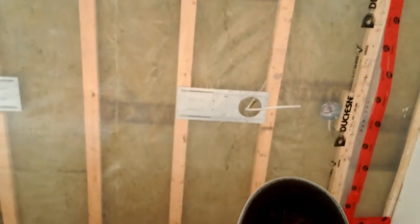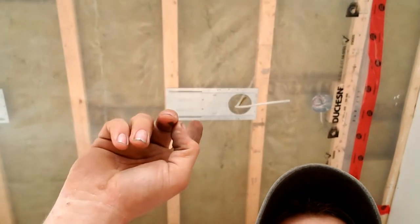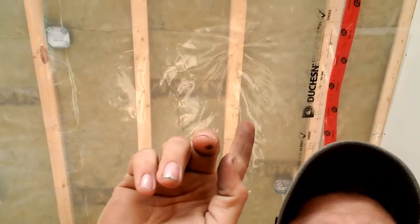We're going to try putting that on now. These are going to be a royal pain because of the electrical boxes - you have to find those holes exactly. My preference would have been to tuck the wires up, leave the steel brackets out, then measure and cut the holes perfectly after the ceiling was up. But now that the steel brackets are in, I have to find each hole perfectly, which could be a challenge. I think it would work really well with a Rotozip. I don't actually own a Rotozip, but I have a Dremel tool with a Rotozip blade, and I've done that once before.